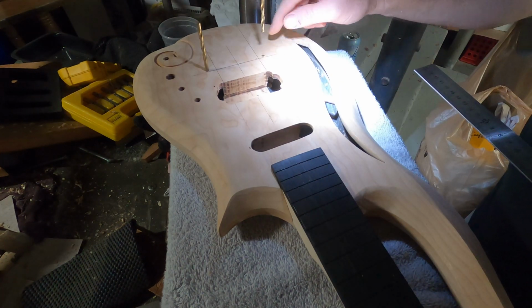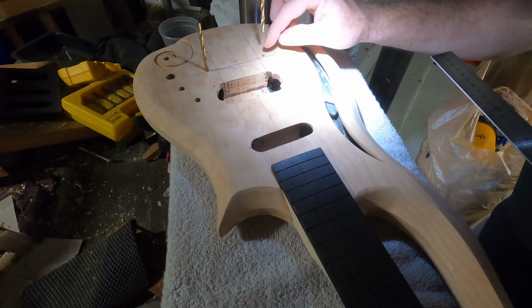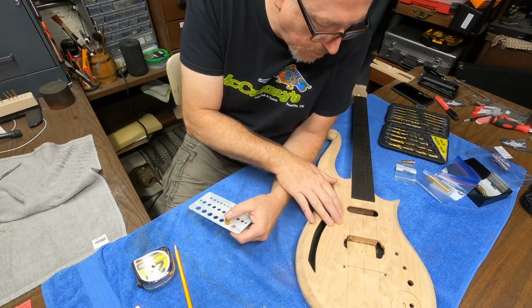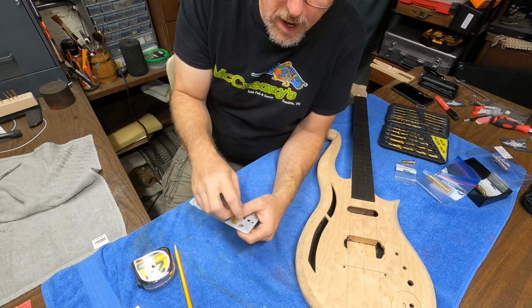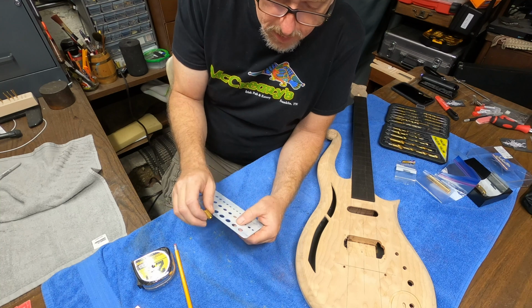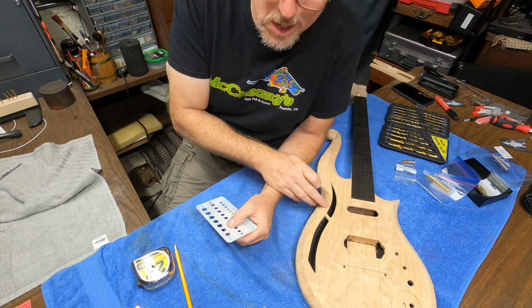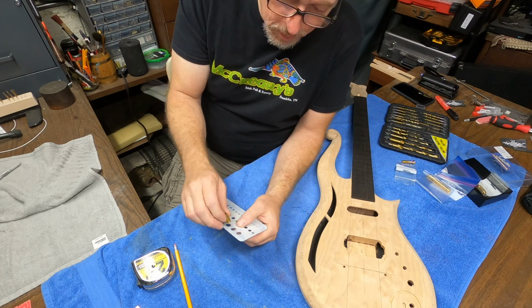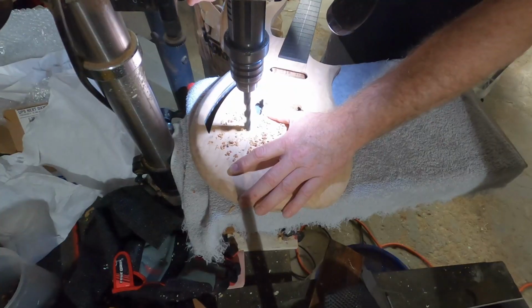This is now my pilot hole, and I'll be able to drill deeper in with my larger bit for the actual anchor. This is a hard maple, and a hard wood like that can crack if you try and put too much pressure in there, so you're just going to the next size lower. If this was, say, pine, then I could maybe go 2 steps down and it would still be fine.